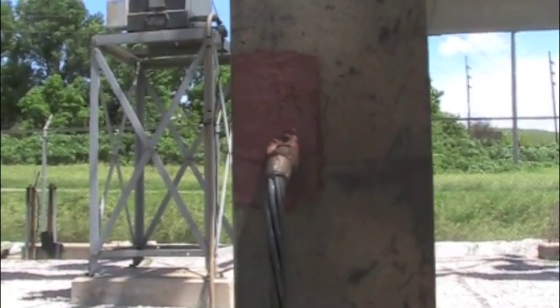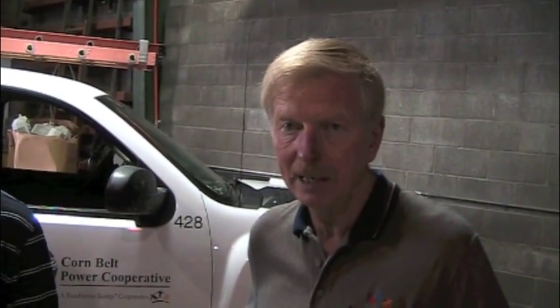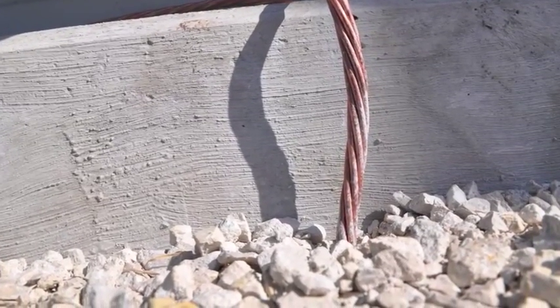From there we've moved forward where our new substation grids, switching station grids, and some motor operated switches — we weld all connections because it is a much better weld, does not break down if it's below the earth line, and just actually takes the weather and stress a lot better and lasts forever.